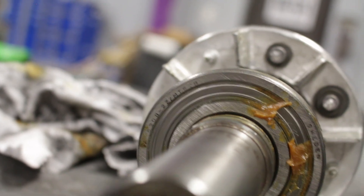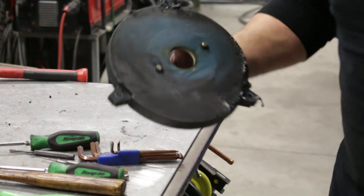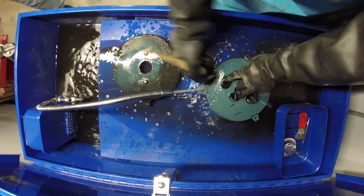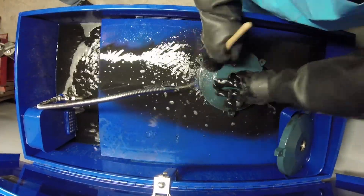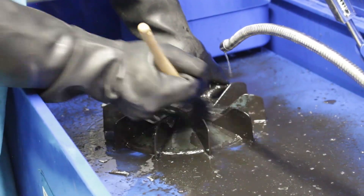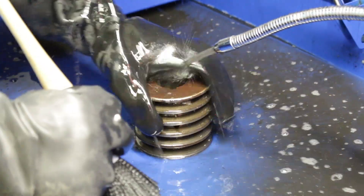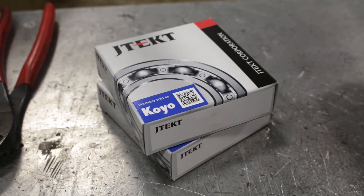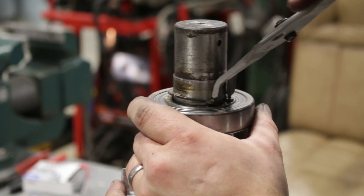Because this motor was so jam-packed with grime, I was debating on exactly how to clean it up and exactly how far to go. I settled on not putting the motor into the wash tank completely assembled to clean off — I think that would have been the most rewarding way to do it, but a local motor shop said better safe than sorry. Don't do it. Just clean out the fins on the body of the motor so the fan can pass air across them to keep it cool. So I'm just cleaning out the end bells and all the other pieces that are easy to clean up in the wash tank, and that's as far as I'm going to go with it.